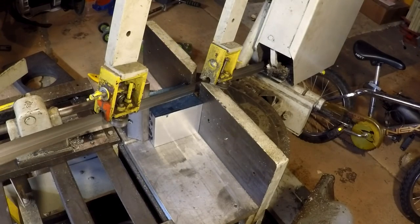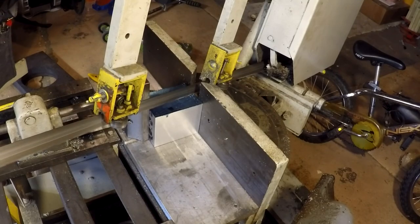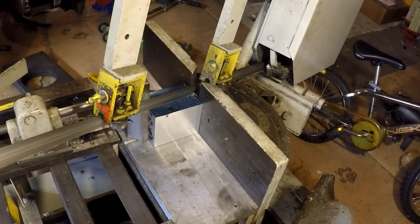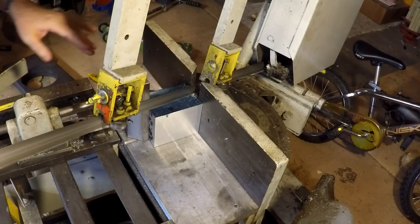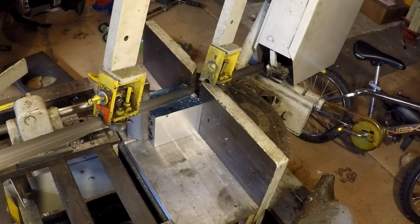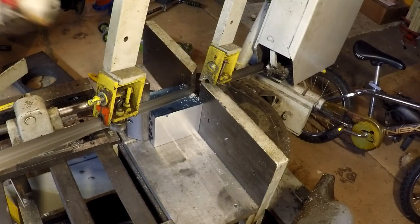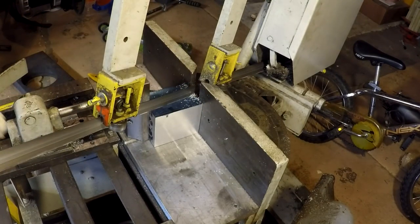We're going to cut this nice and slow because we've got mixed mode, making sure my cut's tracking down my line, my scribe line. Looks like we're going pretty darn good. I can correct this. I'm leaving a little bit of material so I can correct this later on the mill to get it just right. Got my stick lead here.